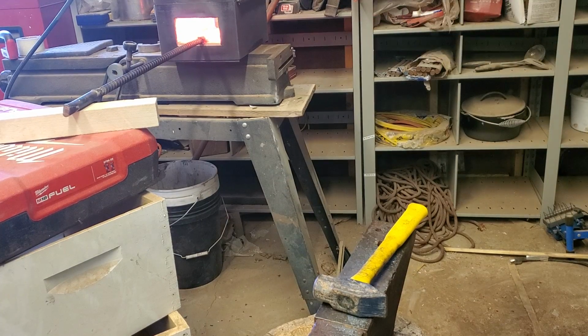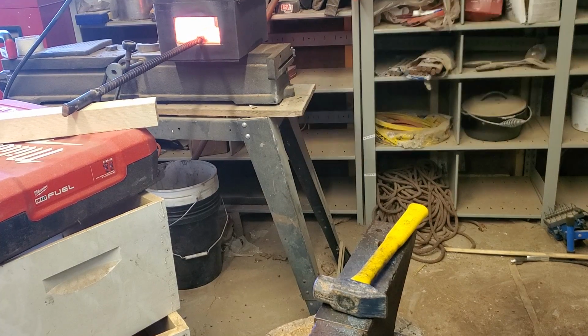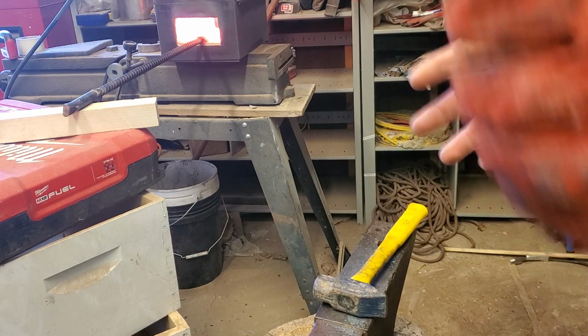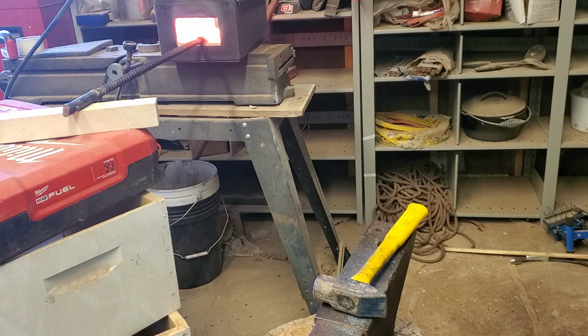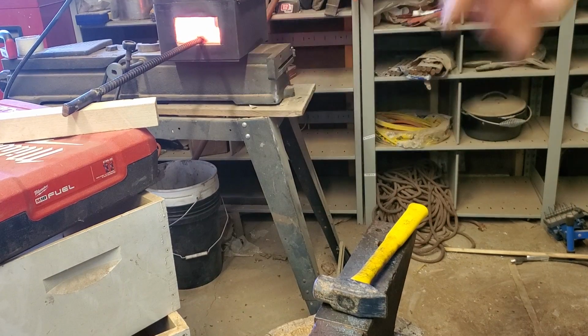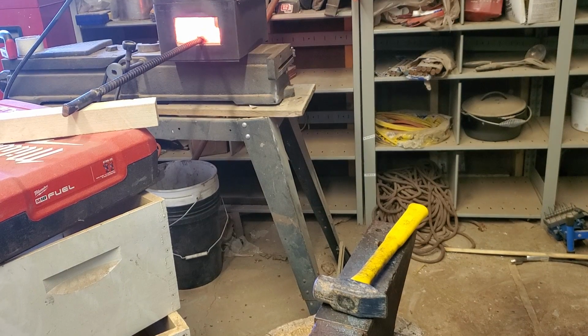I've got the blade about as long as I want. I'm going to even it up now. I'm going to start forging the tang. And the Hells Belle usually has between a 9.5 to a 12.5 or 13-inch blade. So I'm going to shoot somewhere around probably 11 inches. I want to do a little bit thinner blade on this one, but it's going to be a big fighting Bowie with a D-shaped guard. So it should be pretty cool.